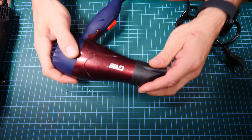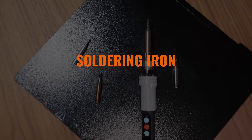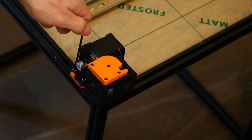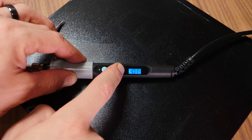I've used a cheap hairdryer for quite some time, but I recently decided to spoil myself and ordered a heat gun in anticipation of my Voron project. Though for most of the heating for that project, I'm going to use... a soldering iron. What does that have to do with 3D printing? Well, you can use it to solder electrical components into your prints or projects to make them more functional — ranging from LEDs, switches, fans, or even custom circuit boards. But what makes a soldering iron essential for 3D printing is that it can help you heat things up for inserting into your print — typically heat set inserts, but also magnets, bolts, or any other metal component you need to reinforce your print. I recommend getting a decent adjustable-temperature soldering iron, even from AliExpress, because it's worth a few bucks more.